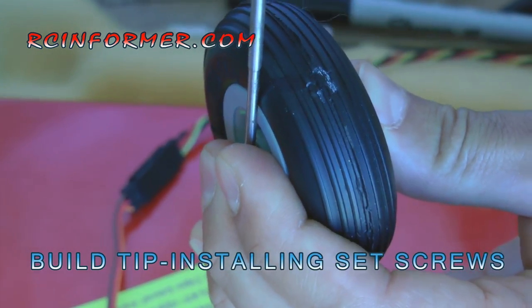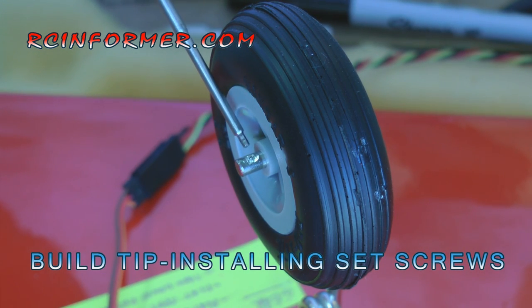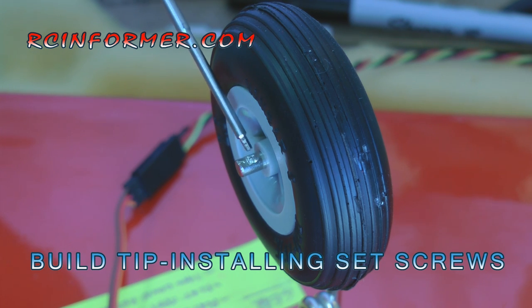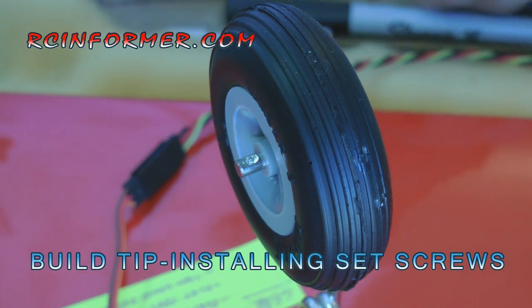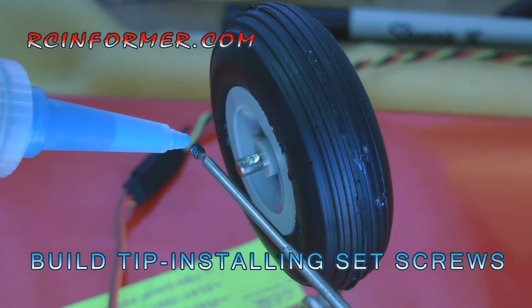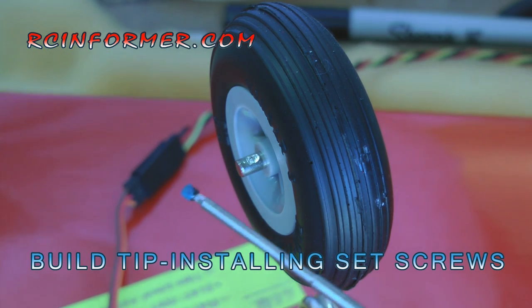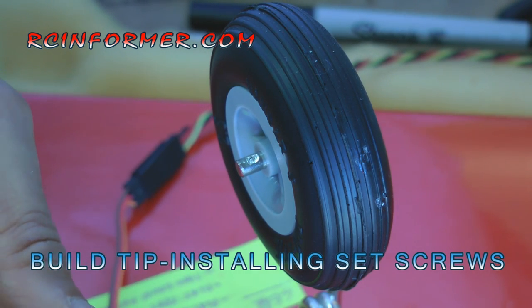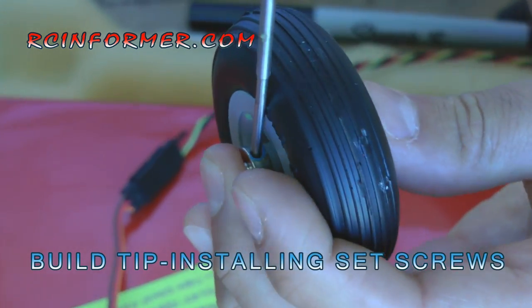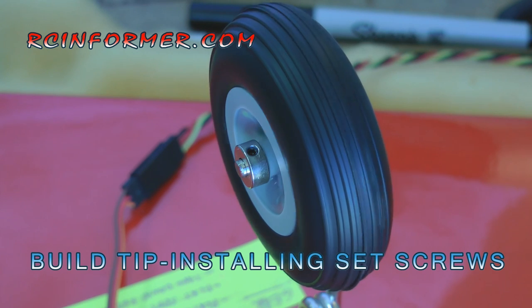Make sure you've got enough play for the wheel to move, and you're good to go. You're also going to want to put some Loctite on there. After you put the flat spot in, the screw actually cuts a little dent in the metal, and that'll help keep it on. Take your blue Loctite — you want to use the blue stuff because the red stuff is really pretty permanent. If you want it to stay in place forever, use the red stuff, but always use the blue because then you can still get the screw off. Put a little bit of thread lock on the threads, put your wheel collar back on, tighten it up, and you're good to go. That wheel should stay on — it's under no load, and that's the first installation.